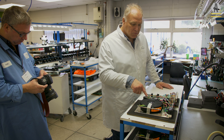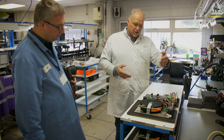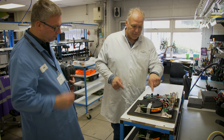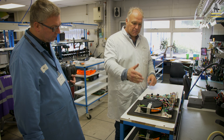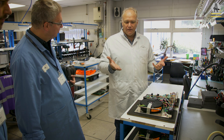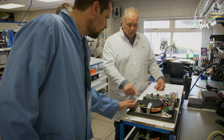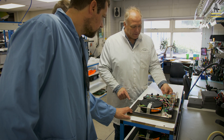You can see these windings are tapped off in this fashion. We could do straight lines, but we do this curve — it adds a spring, it puts suspension between the transformer and the main board, and therefore gives it less chance of transmitting noise. This bit's tied down, the preamp section is floating.